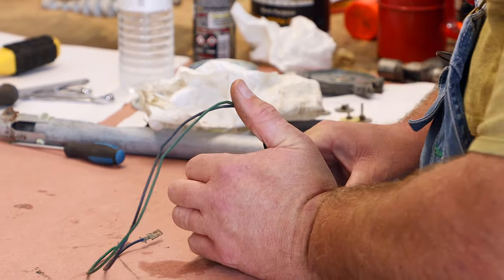So now what we can do is test everything and make sure the clutch is working well. That snapping at the end is the clutch when the mast reaches its full extent. The clutch seems to be adjusted well. There are some measurements you can take per the service manual, but I found that these parts get wear, they'll get a groove in them, the little bumps will be worn, and so it's just best to adjust them until it seems to work right. I mean, there you saw the proper function.